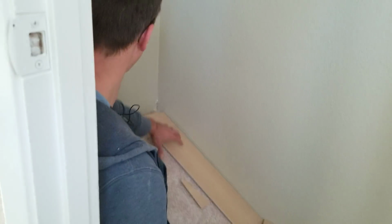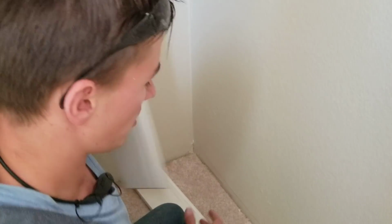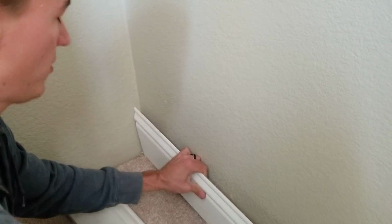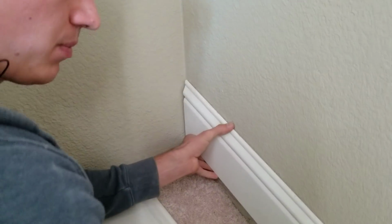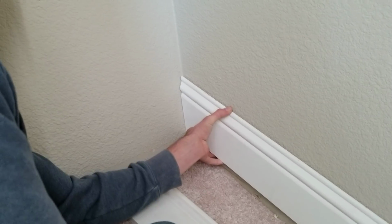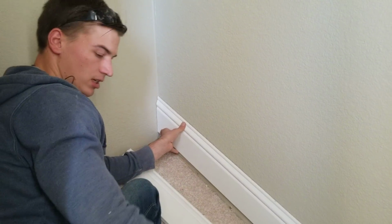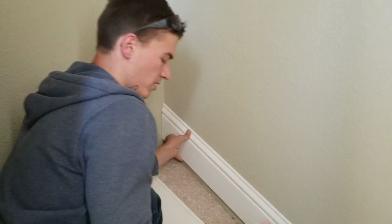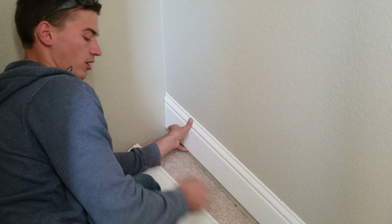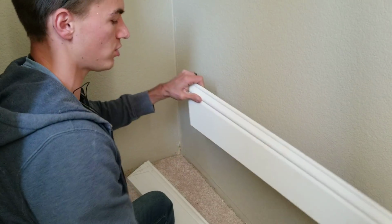And so you do that. And here you go. Where's this piece? Let me remove all this stuff real quick. Here I cut a piece. The reason I'm holding it is because it's too long, it's a scrap. And boom, it fits perfectly. Nice. You're thinking you're a smart man now, or woman. And now we have to put another baseboard here. So you take the next step, and you're like, okay, I'm gonna miter it the way I usually do.